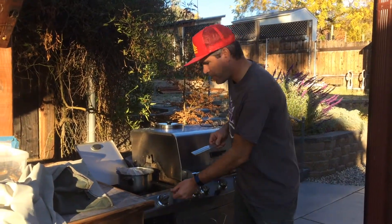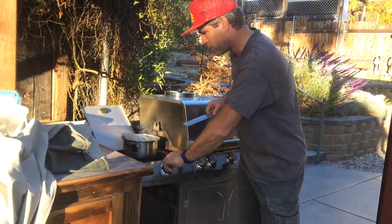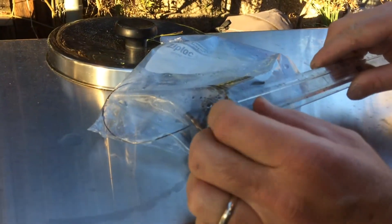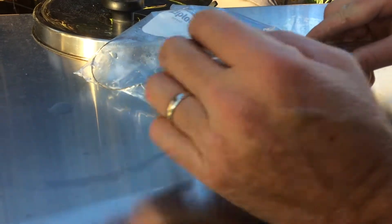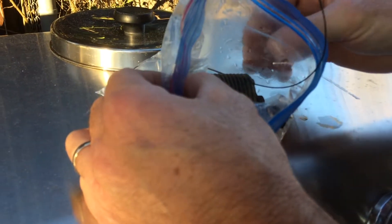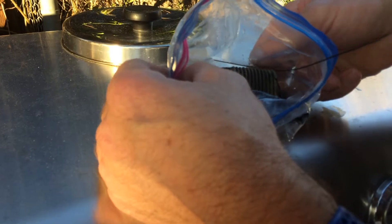The water is up above 200 degrees, about 215 degrees or so, boiling rapidly. Let's turn this off — I can see it's expanded, I just can't tell how much. Taking a measurement, it's up to about 45 millimeters. You can see how the fins are apart a little bit; as they cool they'll gradually compress, and as it heats up it expands.